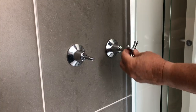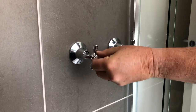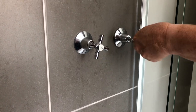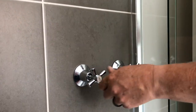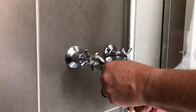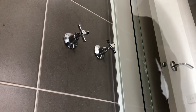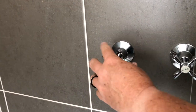Tap handle goes back - hot and cold, hope you've remembered which is which. Then we close the taps now that they're all done up and assembled. Get those slip joint pliers and just give these a little nip to tighten them. We're done - run out the front, turn the water back on, test it for leaks. Beautiful! You can tell these have been lubed - they're really nice to turn now, turning straight off the tap. Really happy with that.